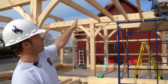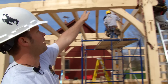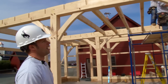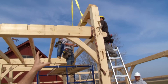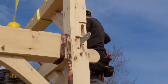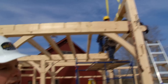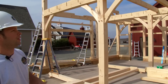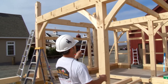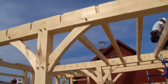The floor joists are starting to lock in place up top. We're setting the top plate — that's the structural beam where all the rafters will sit. You can see right there with the connection our joinery details, how we reinforce them with steel; you can see the steel plate sticking out. All the steel is always fully concealed when we're done, and it makes for a very structurally sound building. You can start to see the arch braces taking place — it gives a nice flowing feel to the barn and adds a lot of character to the interior.